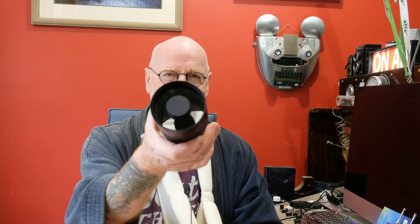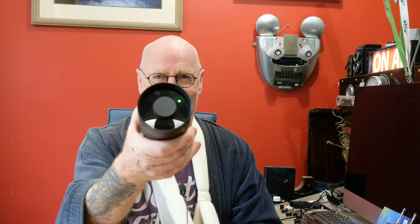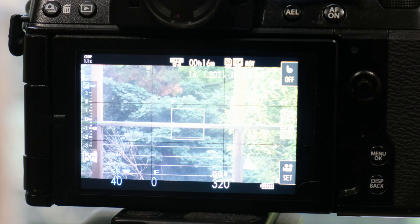For the longer length, I'm using the infamous horrible old 500mm f8 mirror lens. There are plenty of these on the market — some are really nice, some are a bit dodgy, and this one's a bit dodgy — but it will show you how the mount adapter setting affects the IBIS when you're changing between a long lens like this 500mm and a nice 28mm wide angle. I'll be using the Fujifilm XS10 to do the videoing and show you on the menu system how to change the mount setting and what effect it has on IBIS. It really does make quite a difference, so stick around and have a look.